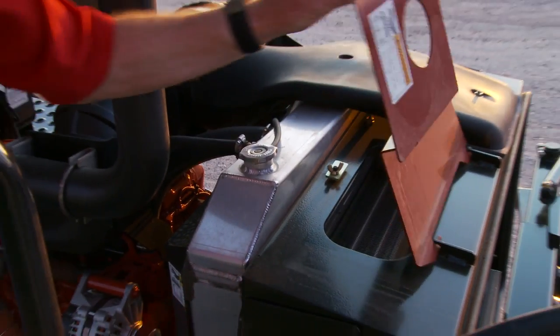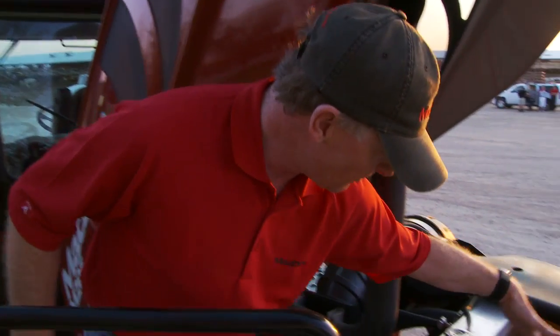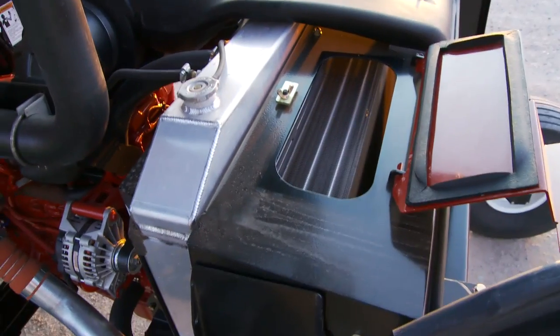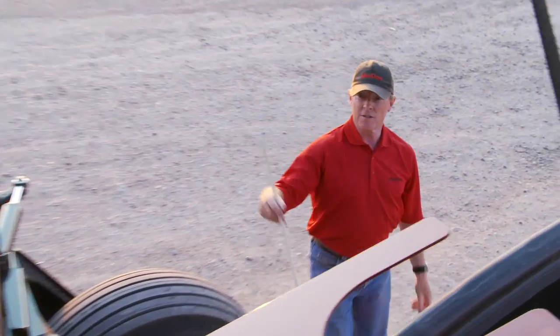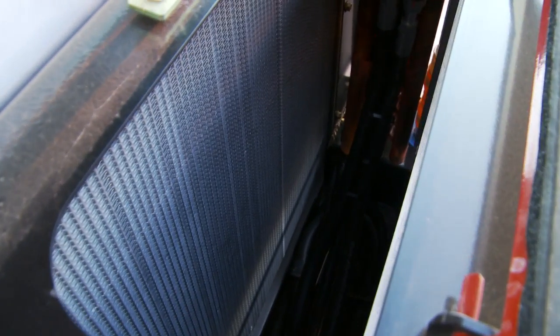This catch will release the top cover and allow us to take an air hose and wand, which we can put down inside here for cleaning out the core. If we slide out the core again, when you look down from the top you'll notice it's very much open — we can get an air wand down inside for blowing out the radiator and the charge air cooler.